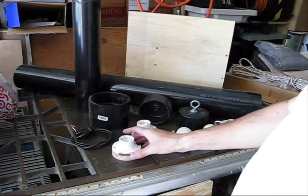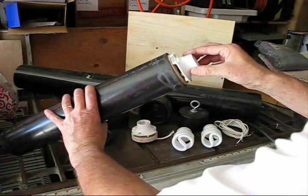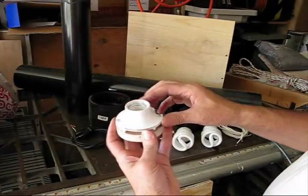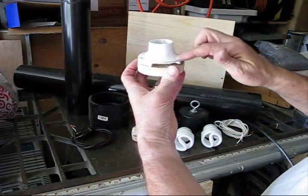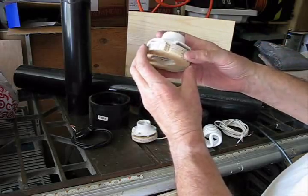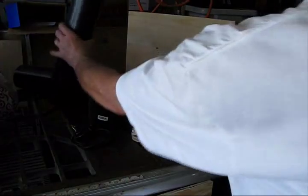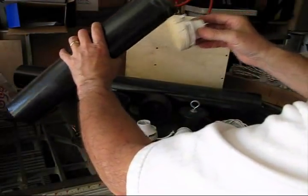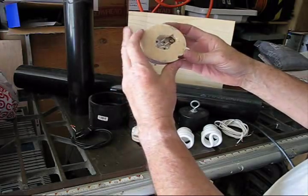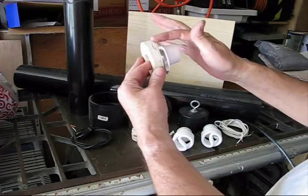Let's take a look at one of the most important parts, which is the bulb assembly. The important thing is you want the bulb assembly to be able to fit inside the tube — recessed. What I did was I measured and cut the socket out, since these are plastic bases, and mounted it to a piece of 3/4-inch plywood as a plug with two screws. I made some slots for the wires to lay flat, and I also drilled the bottom out so I could hook the wires in. This is one of two assemblies; it'll fit into the tube. Take your time with this so it's done correctly — you'll need a jigsaw, a drill, and a grinder to sand the edges.